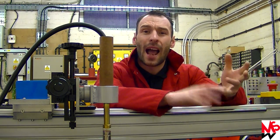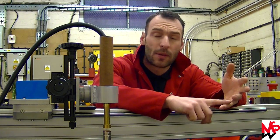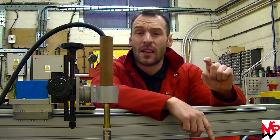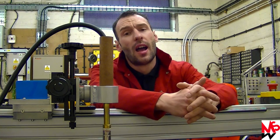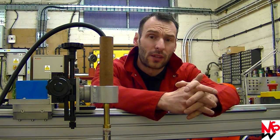If you take away the hours and hours and hours that you would have conventionally with oxy-fuel damaging the parent material, using your cutting torch at an angle and having maybe 5 or 10 mil worth of material left on that plate to fettle off, I think FLUSHCUT and the consumable price speaks for itself.